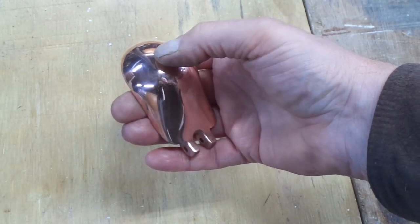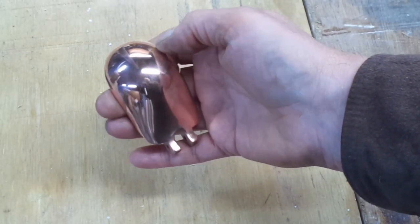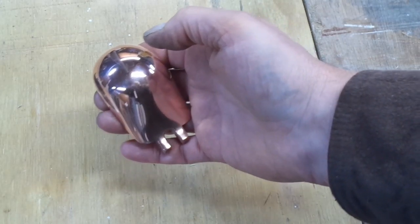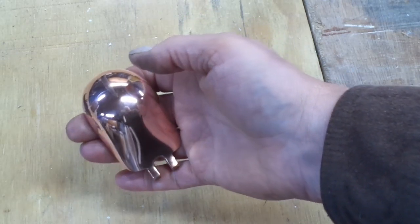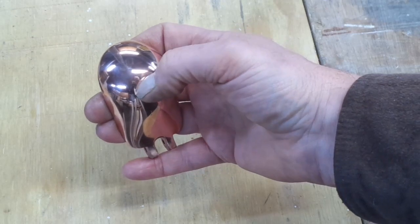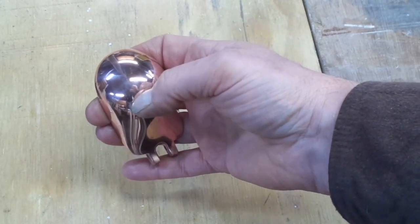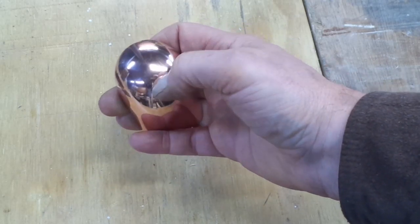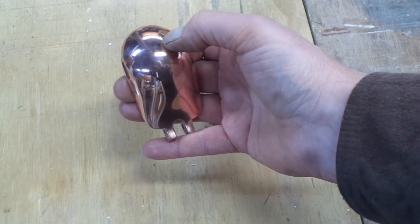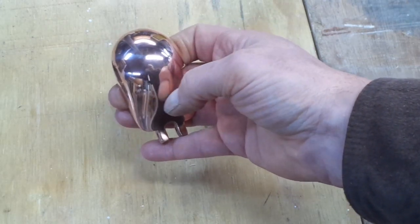My initial copper plating was about 15 minutes at 3 volts. I tried to do thicker plating by stepping up the voltage, and I wasn't happy with those results — the copper plate was very uneven and rough. So I ended up going with longer plating times instead: something closer to 45 minutes to an hour at 3 volts. I polished and ended up inadvertently getting a very thick copper plate. The pits weren't filling in — you can't think about plating as filling, the way you might with wood filler, caulking, or Bondo. Eventually I sanded it all away, but lo and behold, I did end up filling in a lot of the pits. Once the pits were filled, it was a matter of continuing to polish and buff.